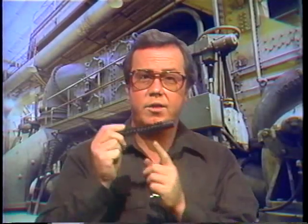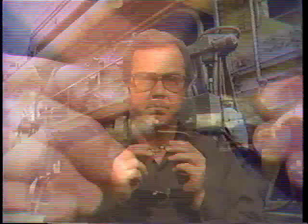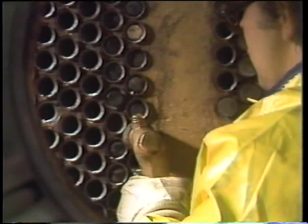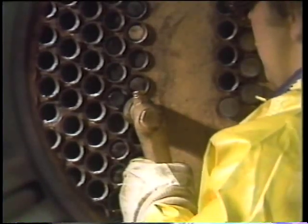The third tool used to shoot tubes is a tight-fitting wire brush with rubber plugs at both ends. The rubber plug pushes the brush through on the stream of water from the gun. The plug that goes through first clears any soft deposits, while the brush removes harder deposits and scale. The fourth item is for really heavy hard deposits on strong tube materials such as stainless steel — a finned scraper bullet that scrapes loose chemicals and corrosion deposits that even wire brushes won't remove. In practice, the worker inserts a bunch of brushes at one time into a section of tubes — he may do several hundred at once — and shoots them through one at a time with the high-pressure water gun.